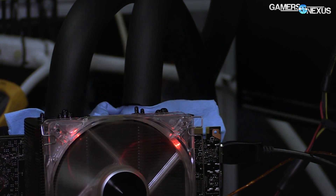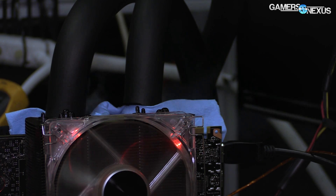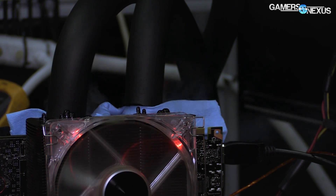One of the things we did a long time ago was switch to the mini DisplayPort connector, so if somebody uses a water block, they can keep a very slim, single-slot profile. People liked it, so we kept carrying it over from previous KP cards. We didn't want to do 2.5 slots — it's too big. If you run 4-way, that wouldn't work. Going down to 2 slots gives you an edge.